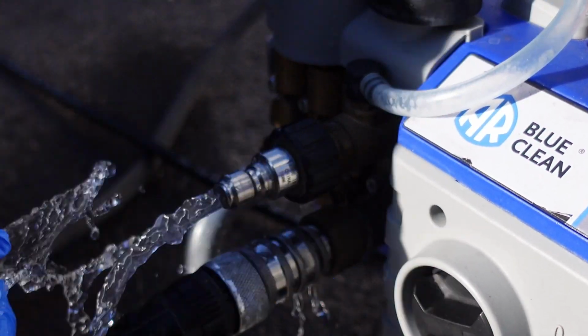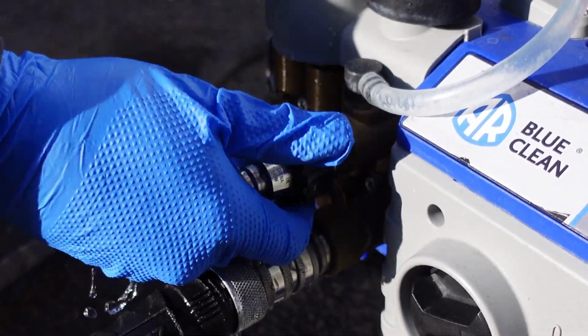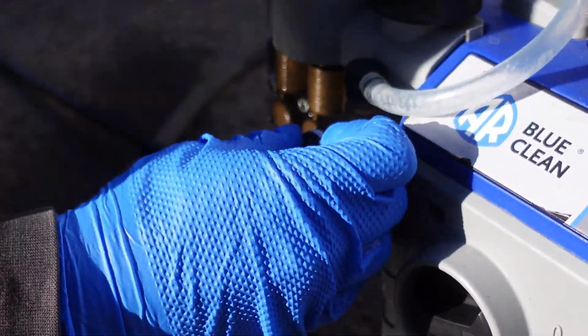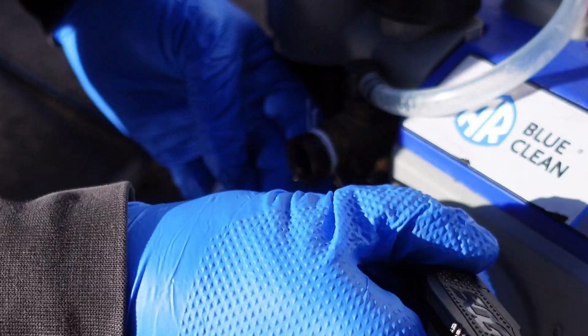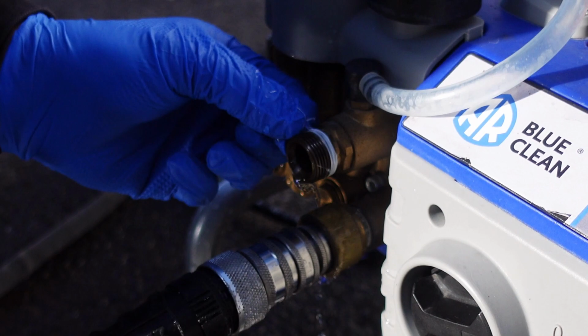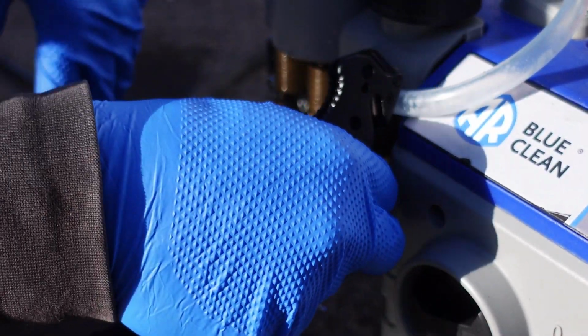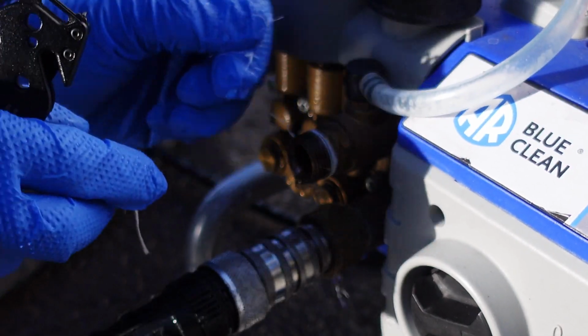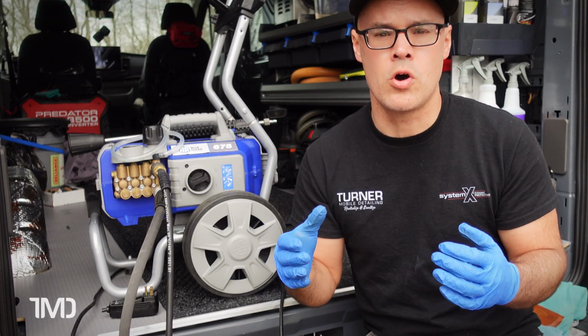You can see that the Teflon tape, I had already stripped most of it off prior to making this video, but you can see there's still some left. When I originally inspected the connection, it was pretty worn. It was all but gone. So really it's just a matter of replacing the Teflon sealer tape, made really specifically for water joints.